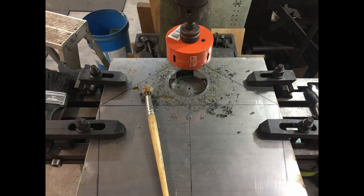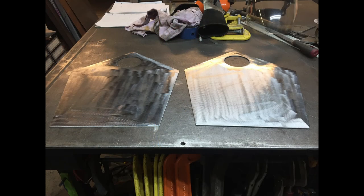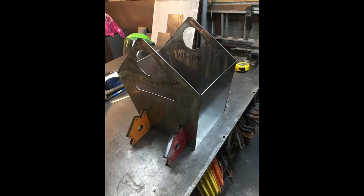That hole was cut with a large hole saw — around 90 or 100 millimetres, so either four inches or just under four inches in diameter. Then I cut out the rest of the shape and split those bits of metal apart where they were tacked together, ending up with the two pieces. I used a flap disc to run over them and clean off any mill scale. On one of those pieces I cut a slot for where the letters go in. Then I made some sides and you can see in this photo that I started to weld it together using right-angle magnets to prop it up, tacking all the sides on along with the bottom.